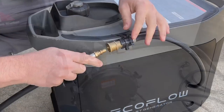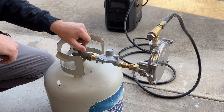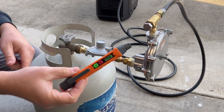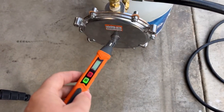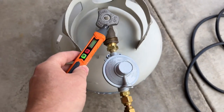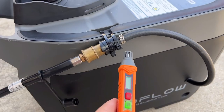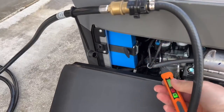The load regulator screw should be loose so it can be changed. Put the quick connect into the generator — nice and snug. Now we'll pressurize the system and check for leaks using a special leak-detection tool that sniffs out propane — it's ready in 30 seconds. Sniff around all connection points. The system is under pressure so it should pick up any leak. Checking all points so far — nothing detected.